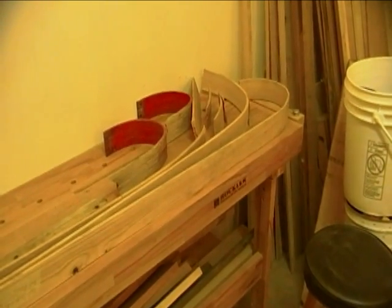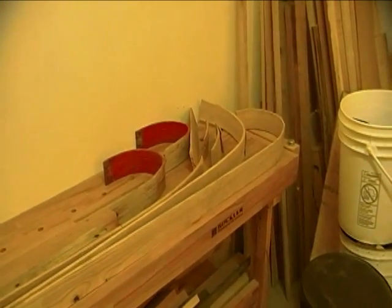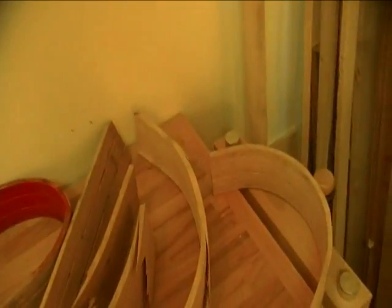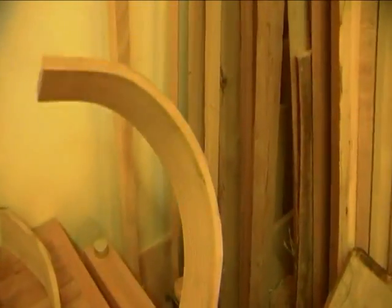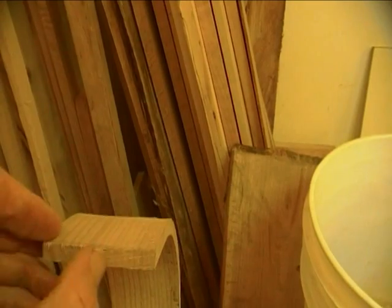I had 4 white oak logs sawn, and I took them to a local bandsaw mill guy, an Amish guy in the area, and asked him to quarter saw them, but he didn't understand what I meant, so for the most part, these aren't very well quarter sawn. This one definitely wasn't. One of the big changes here, I forgot to mention, is that this is really quarter sawn wood, and you can see that the grain is almost vertical to this dimension. So that's about as quarter sawn as you're going to get. Actually, rift sawn, I have now found.